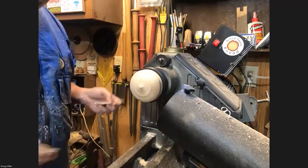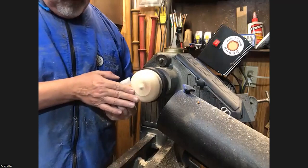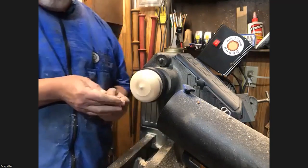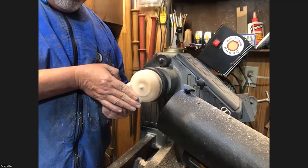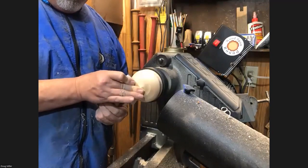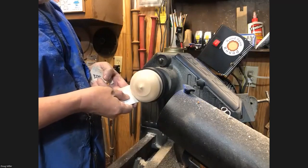So I've turned a whole bunch of Christmas trees. And so all of that, I got a trash can over there full of shavings, and the floor could still, I could about fill another trash can up. But I was turning those at 2000 RPMs. I turned five at a time without turning the lathe off. Using a step center in my headstock, that spring-loaded center. It does a phenomenal job of giving you just enough room where you can get the blank out or get a new blank in, take the one you just turned out.